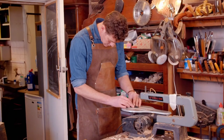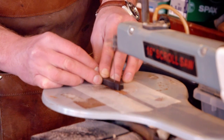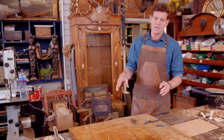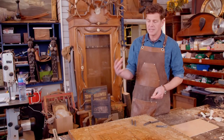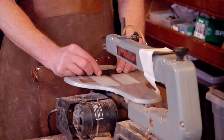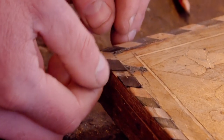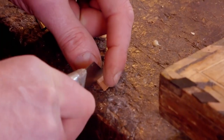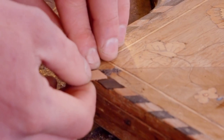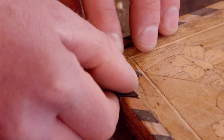In Alex's workshop, the marquetry tables are receiving their finishing touches with the help of some repurposed wood. This is ebony timber and boxwood. Ebony, obviously, you can't buy any more — it's an endangered species of timber. But what I tend to use are old piano keys; we break them up and repurpose the timber. Those pieces are fitted really nicely. I just need to do a little bit of boxwood to go in between, and then we can glue them on. Once that glue's set, sand it smooth and wax it again.